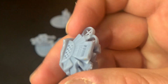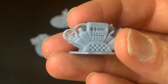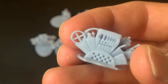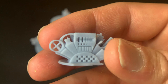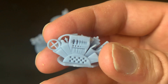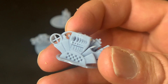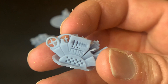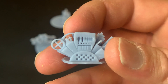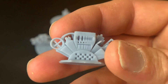Now we'll go to number 1, the last one to shut off — the highest exposure. If you look at number 1, the cross in here is very thick, a lot thicker than it's supposed to be. That's the nice part about having 8 of these — you can compare them side by side and identify which ones to set aside. Looking at the gaps, there are measurements to the tenth of a millimeter to help us identify where our exposures are. If it's overexposed, they'll fill in; if underexposed, you get what we saw in number 7. So this one is obviously overexposed.